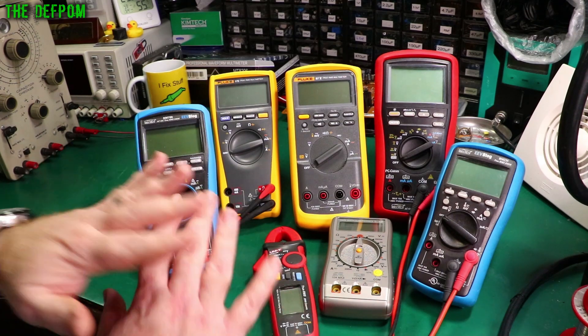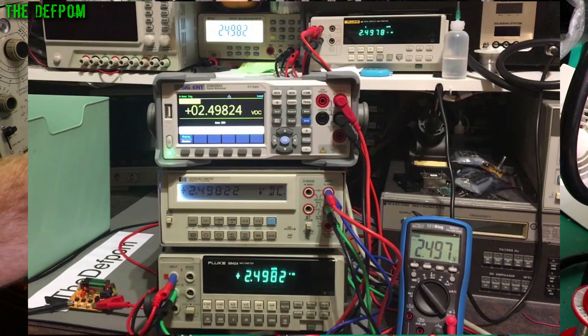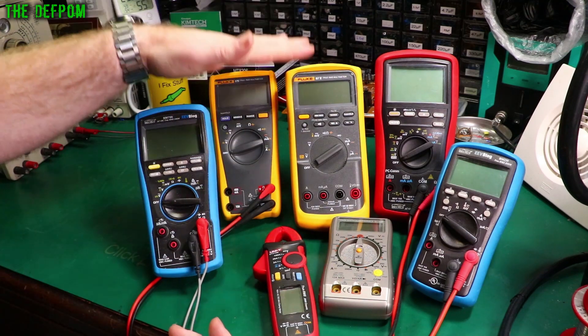Something I haven't even mentioned — these are just handheld multimeters. There are also desktop multimeters and benchtop ones, which come in various sizes. Up here for example I've got a Siglent SDM3065X, which is a six and a half digit multimeter that does basically everything and a bit more — that's a precision multimeter. There are also lower models like five and a half digit, four and a half digit versions as well, which are cheaper. There are also other brands like Keysight — loads of them. You can even get budget brands from China in that format which also work quite well. There are also the older-style formats which are quite wide and big bulky ones — those can be handy if you've got bench space and you can get them quite cheaply used. Another great one is a Fluke 45, which is quite a good four and a half digit benchtop multimeter by Fluke with the same sorts of features. I find the handhelds are more convenient personally — if you have a benchtop one you're tied to being on a bench and that's it, though sometimes that's all you need.